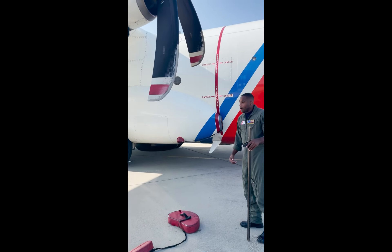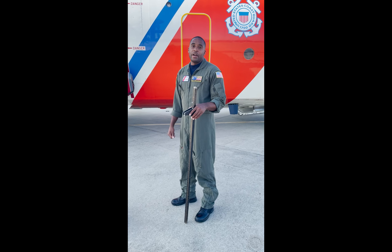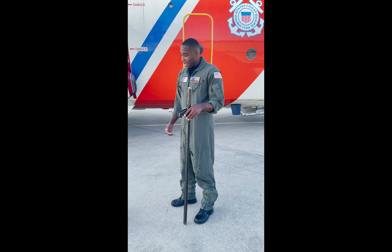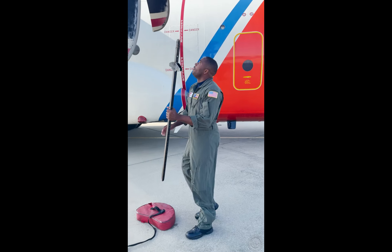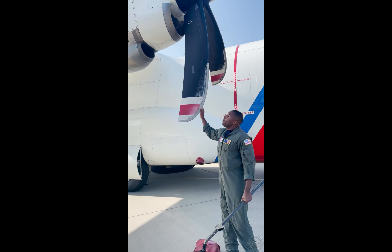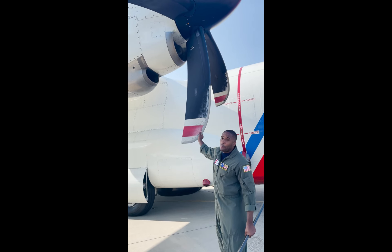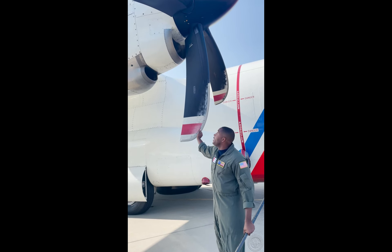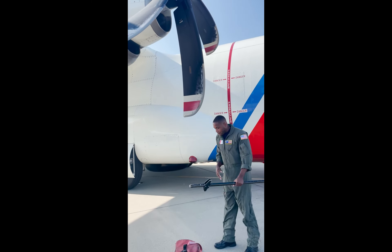After our flight, we want to make sure there's no debris or any other foreign objects getting into our engines, and we're going to do that by installing intake plugs. First, we're going to turn our propeller counterclockwise so that we can get our intake plugs into the intake. That gives us the room we need to install our intake plug.